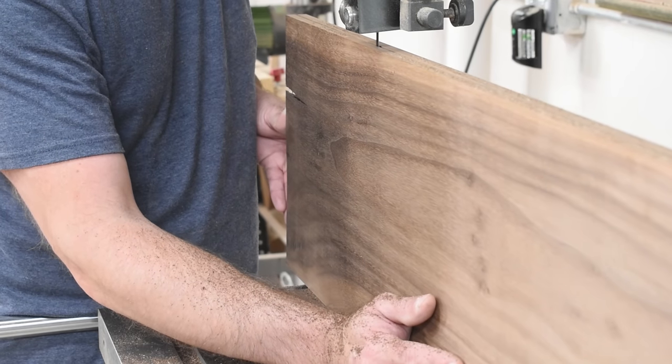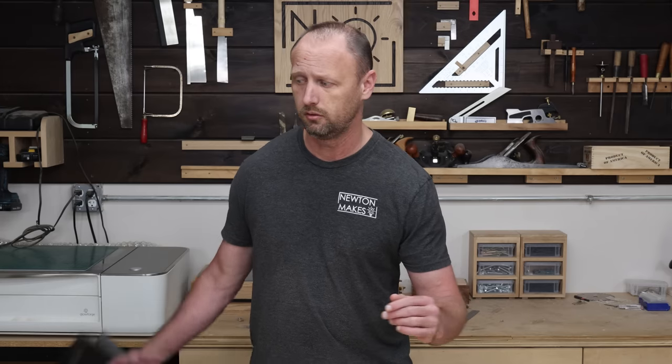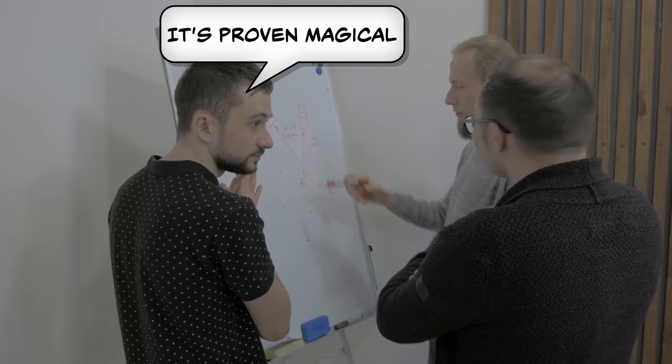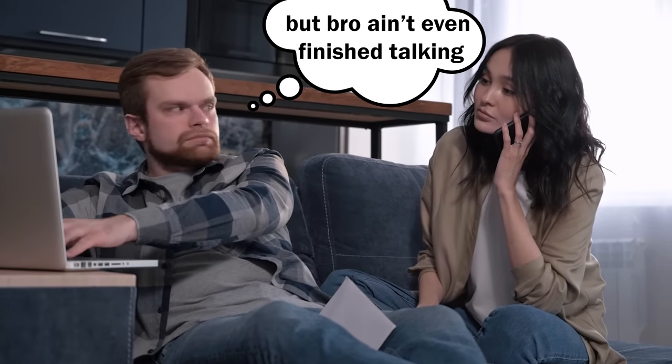It's pretty common for people to pause a video and leave a comment without watching the whole thing through — one thing I expect to see is: 'The problem is you're not using the right blade. If you're using the Laguna Resaw King blade, all the things you talked about are completely eliminated.' You mean like this? Yep — I got a Laguna Resaw blade. I've had it for a while and it's a good blade. I totally get why people talk about it; it is really good for resaw work. But I can also tell you I'd still rather use the table saw. While this blade provides a much better cut than a lot of other bandsaw blades, it still has some cleanup work. Some folks claim they get super glossy cuts with not a single blade mark and no blade drift — those claims get a little over the top. It's a good blade that helps with all those things, but it doesn't 100% mitigate any of the cons on my list.